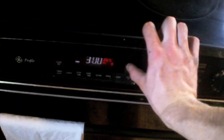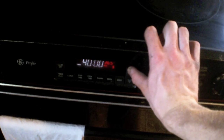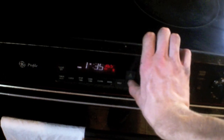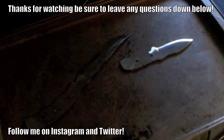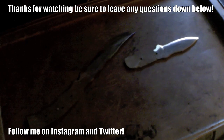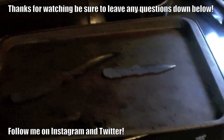What tempering does is take any brittleness out of the blade and give you maximum strength. I've heard of people doing this with a blowtorch, which can work pretty quickly, but I'm not sure how well that works. The reason I like the oven method is because it heats the knife uniformly — everything is the same temperature and you're not getting any weird heat spots. I'd recommend this way, but if you can't, look up alternative methods online.